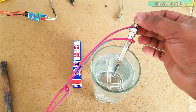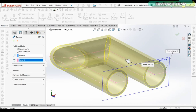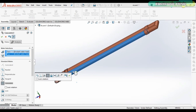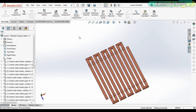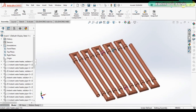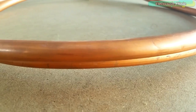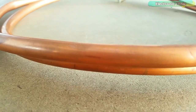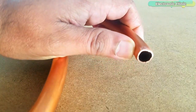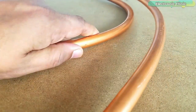I didn't stop here. I decided to design my own heat exchanger using copper tubes. I usually use SolidWorks for designing enclosures and mechanical parts. Prior to designing, I measured the diameter of the copper tube I'm going to use. This is my basic copper coil that I'm going to start with. I purchased this 9-feet long copper pipe with an internal diameter of 13mm.